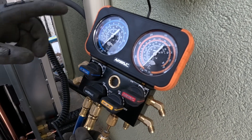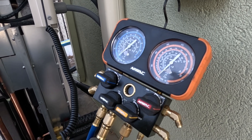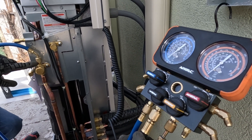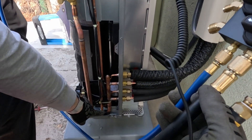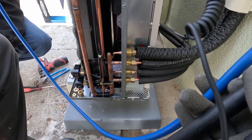You can evacuate from either side, but on mini splits — especially Mitsubishis in particular — if it's smaller than a three-ton, you only got one port. This is connected to your manifold, and it goes to each line, which is your evaporators.